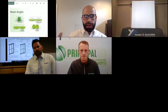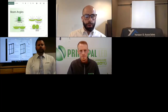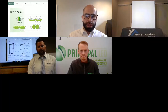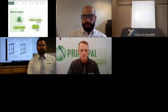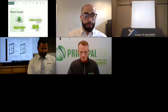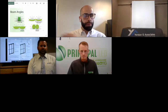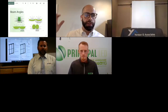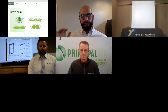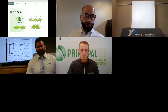And to tie in a little bit to Adam's question, optic lens existed because we wanted to use less product and get shallower. But we still oftentimes are victim to hotspots because of output. So hypothetically, in certain thin scenarios, if you had like a 3 or 4 inch deep flex and you put Quick Mod 4 in there, I don't know that you'd be able to do it without having shadows, because the output is so much from that Quick Mod 4 that we're not able to get any of that overlap, just the brute force of it. But you dial that back to Quick Mod 2 and it's easy sailing, right? So sometimes it's a dialing in of optic technology versus output. And sometimes too much output is actually not doing you any favors.